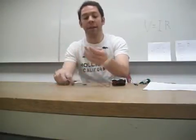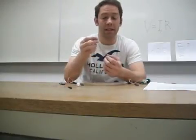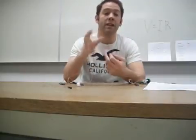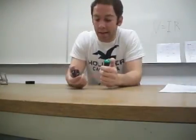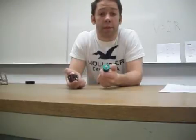But when you attach the batteries, make sure that when making one circuit, as we saw in the diagram, one side is attached to the plus side of a battery and the other side is attached to the negative. In the other circuit, it needs to be the opposite so that the circuit will go in the opposite direction. And you'll just do the wire in line to the switch, to the battery, and back to the other side. Okay, when it's completed, you need to make sure that each switch will spin the motor in the opposite way. So this switch spins it one way, the other switch will spin it the other way.